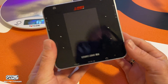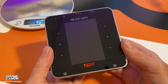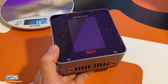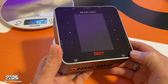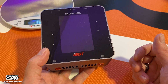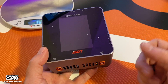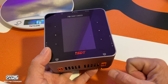It is very simple to use. The charger has a lot of basic functions that give it great value. Number one is Bluetooth — you can load up the ISDT Bluetooth app on your phone. There's a QR code inside the manual that takes you to Google Play or the iOS App Store. Either way, you can have all the information that's normally on the screen right on your smartphone, make changes on the fly, speed up the charge process by increasing the amperage going to the battery, and keep tabs on how the battery is doing while walking around your house.